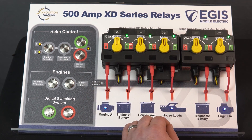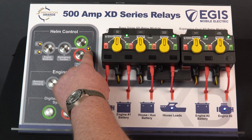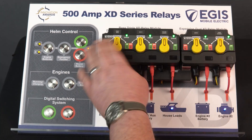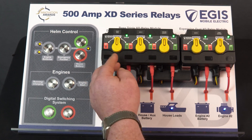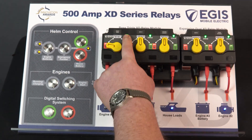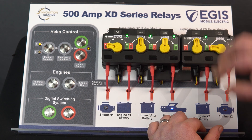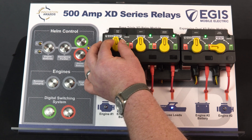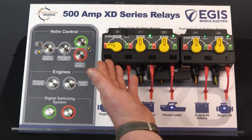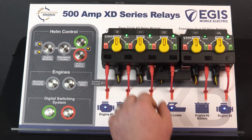On this demo we have also highlighted remote LED indication. We have one and two LEDs representing our engines and an LED for the battery bank, configured remotely, mirroring the LEDs displayed physically on the device. The manual override knobs: all the way to the left is force off, straight up and down is auto, and to the right is force on. Shutting one off puts that relay into a double-flash state, also indicated on the remote LED. Going back to auto mode means the relays instantly re-engage. The double flash is a safety measure to help ensure a forced manual override is returned to remote automatic control as soon as possible.